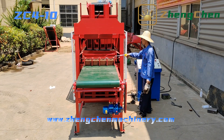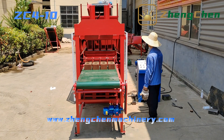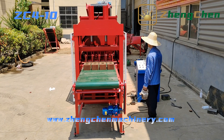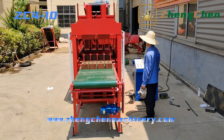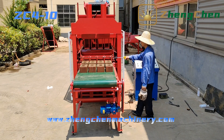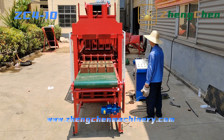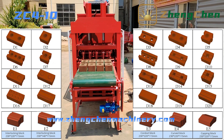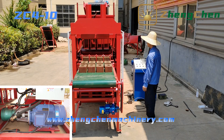Now let us see the brick production together. The ZC4-10 is an interlocking brick machine. Production can be started by pressing the start button — it doesn't need one person to operate the PLC control box constantly. For a 300x150x100mm brick, it can produce 4 pieces per cycle, about 7,600 pieces in 8 hours. It can also produce many different shapes and sizes by changing the brick molds. The host machine power is 15kW.